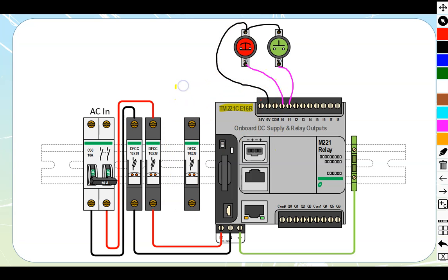The most common mistakes made with sourcing is that people will set up the negative out and around, but forget to connect the positive from 24 volts to the common. We do want to put that jumper in with a proper fuse holder — even a bare jumper would be better than leaving it open, but without it there would be no way for the circuit to be monitored. So put it in properly.